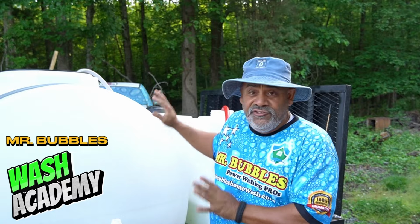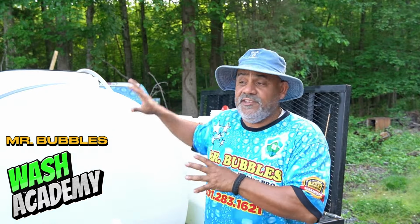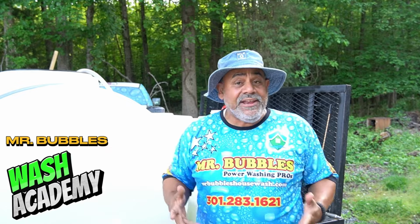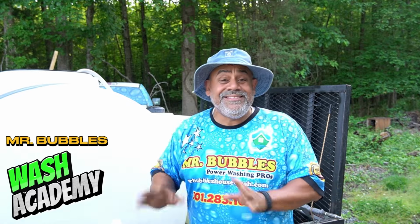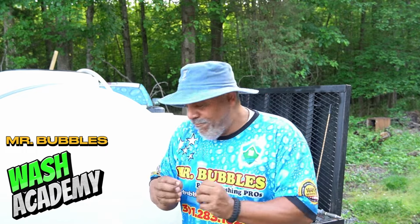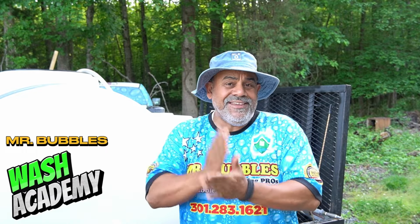Now, on this truck, I have a roof pump, and I have a metering system, and I can transfer chemicals as needed. But, of course, you guys starting out, you're not going to have that. 98, 99% of you guys are going to be batch mixing, and that's how you're going to do it. 50-50 mix, half water, half bleach. And then you're going to put one cup of surfactant for every 10 gallons of mixture.